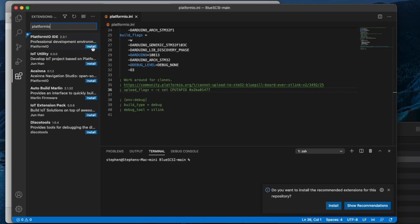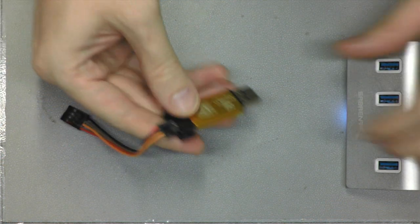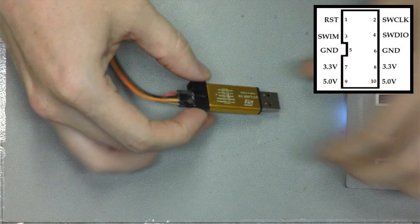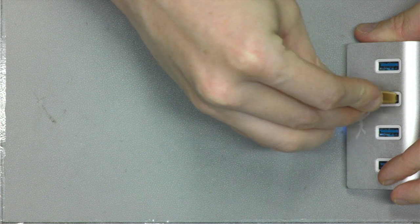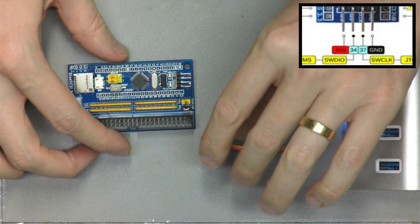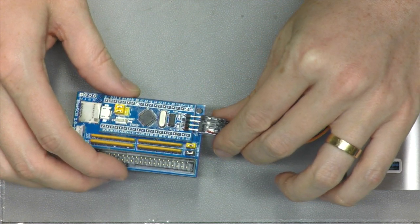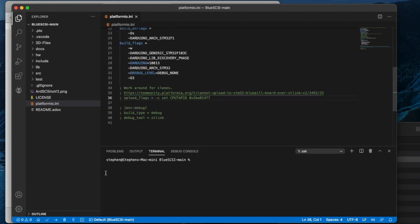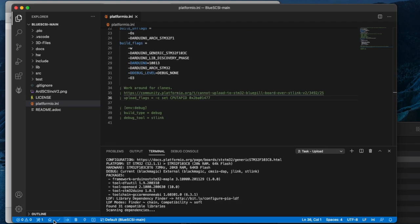Now it's time to plug in the STLink and hook up the programmer to your BluePill. The pinout between STLink and BluePill are in the description as well as in the video. With the BluePill controlling your BlueSCSI plugged in, you can now proceed to upload the firmware in PlatformIO.